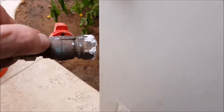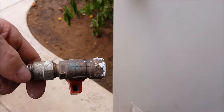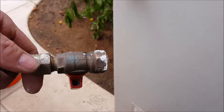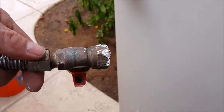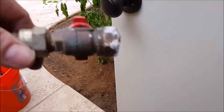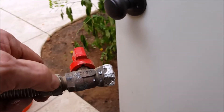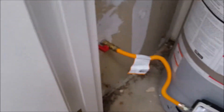To me it's a ten-dollar part — no big deal — and it's good insurance against a potential gas leak on an old valve. The one upstairs came apart fine so I'm not concerned about that one. I did use a gas sniffer upstairs and didn't detect any gas in that room. The homeowner mentioned she had some gas smells up there before that made her dizzy, so she'll need to monitor that area as well.